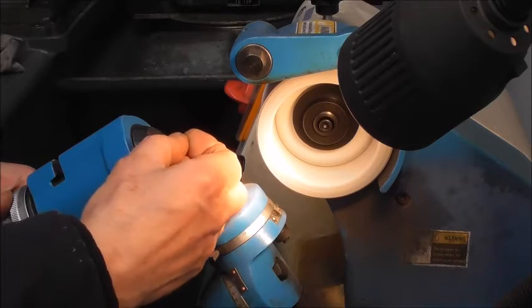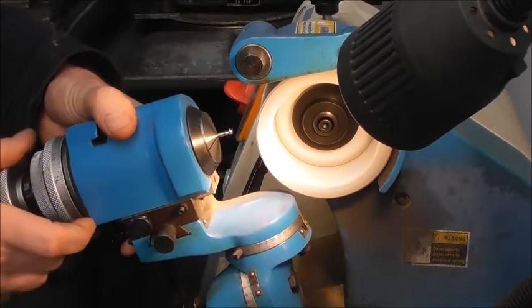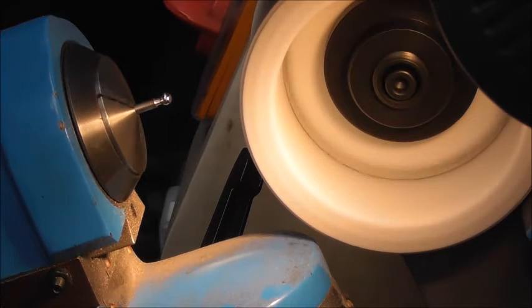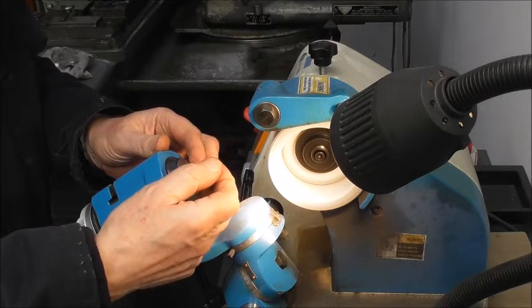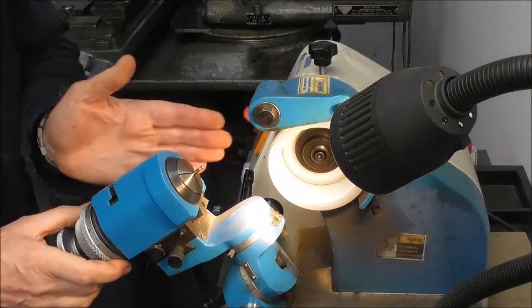The hole in the ball is always hiding on the other side. You can see that there - that's the spigot diameter ground to a nice fit for the Loctite. Now we're going to grind the taper coming back from there to give nice clearance in its application of use. We've ground the diameter to suit the spigot hole in the ball, and that fits on okay.